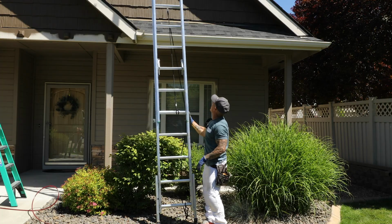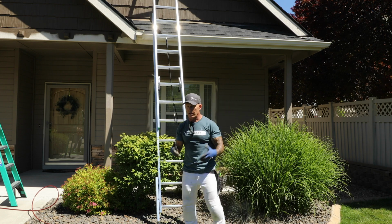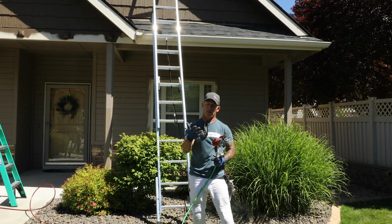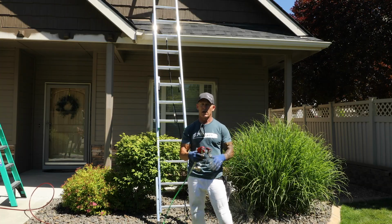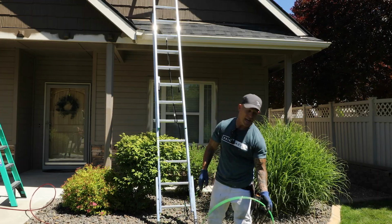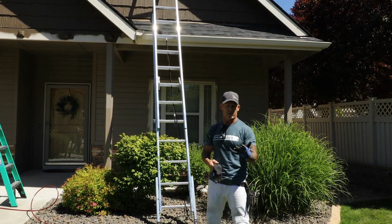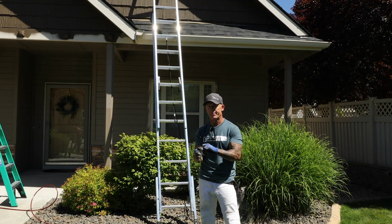having gloves on. So if you're painting an exterior, it's definitely a good idea to wear gloves. The spray guns, sitting out in the sun, get hot, so you're not gonna burn your hands when you're grabbing the gun with gloves on. Also, it helps grip the gun, but there's just a lot of other reasons. At the end of the day, you're not gonna have as dirty of hands wearing gloves too, and I don't like to have to sit there and just scrub all this paint and grime and stuff off my hands at the end of the day.